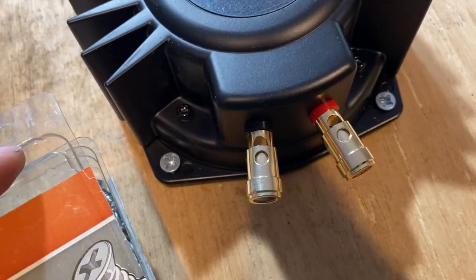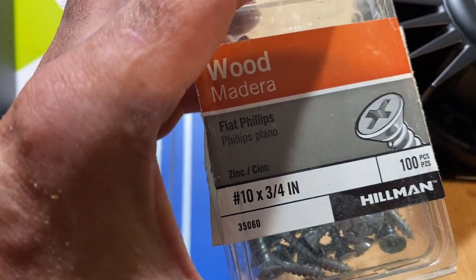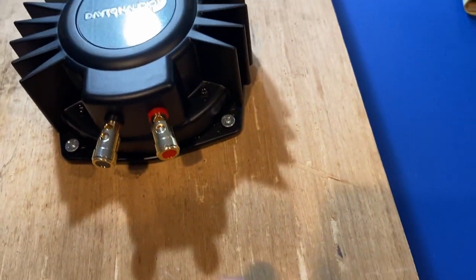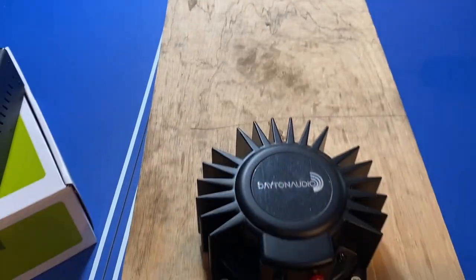I've got all four of the boards cut, so what I'll do is drill three or four holes on each side and put in wood screws — on both ends, on all four boards. This one happens to be three-quarter inch birch plywood, good and strong. The bass shaker is firmly secured to the board with number ten wood screws, three-quarter inch. Now I'll put four number ten screws through the frame of the couch into the wood on each side — four on each side. That should firmly secure it. I've got all four of them mounted, nice and strong, solid.